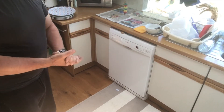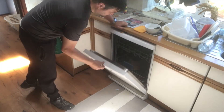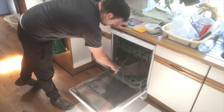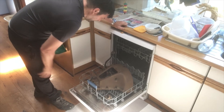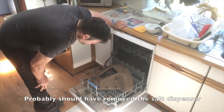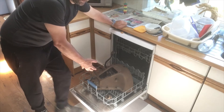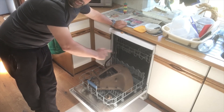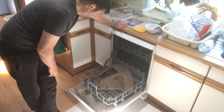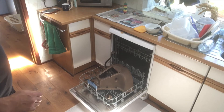The trusty dishwasher has finished the job — let's see what's happened. It's a little bit hotter than usual, I wonder if that's because of such a large chunk of cast iron. Got a little bit more flash rusting than expected, but kind of expected that. Those black bits are still there — I'm sure they're just paint. It's had oven cleaner, degreaser, gun wash from my spray gun all over it, and it's been in the dishwasher, so it must just be old paint deep in the cast. Looks good — the dishwasher looks okay too. Cool, now for paint.